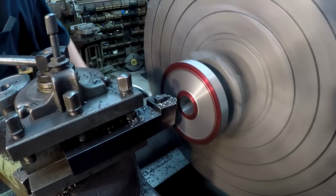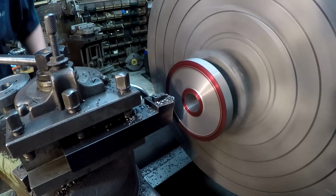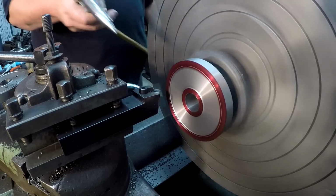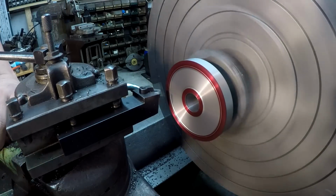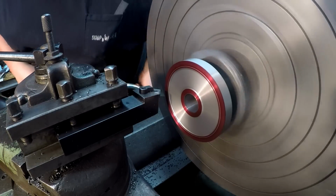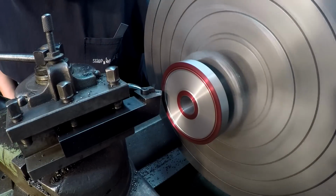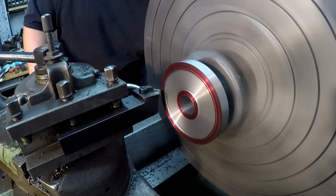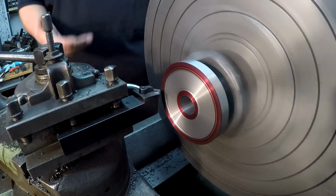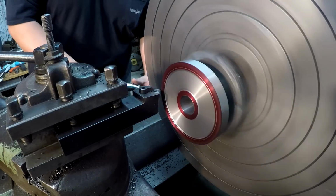All right. I'm going to do that inner one last. Let's go ahead and try this one. So this outer one is going to be 10 thou. I think I went about 1/1000 deep on that other one when I touched it. So we may be about 23 deep in that middle section, which is just clearance. All right, that one we want 10. We'll go ahead and move it in 10.